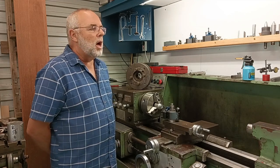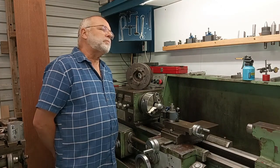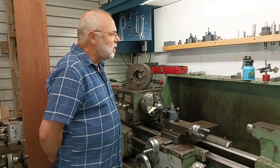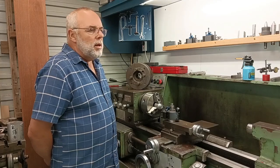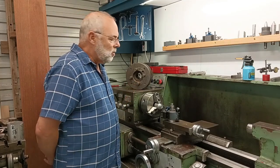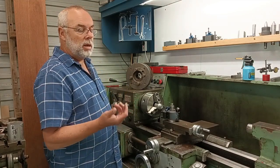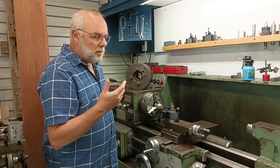Having three-phase is a bit unusual — quite often in the hobby market there are single-phase machines, or three-phase with capacitor-start motors, and that's problematic on machine tools. Because this workshop is three-phase, I can buy basically industrial machines, as long as I can get them into my backyard.